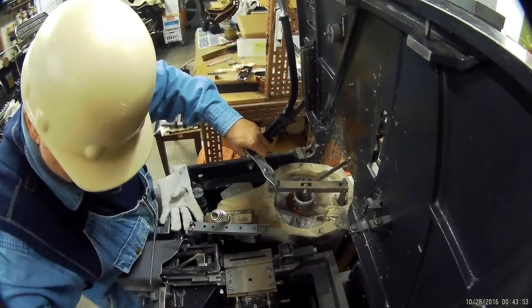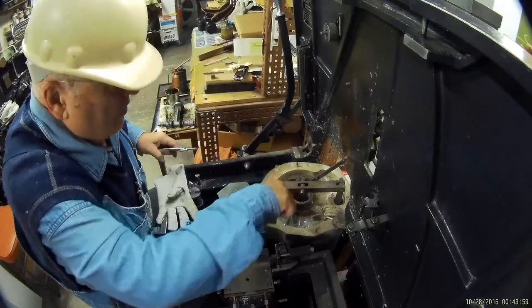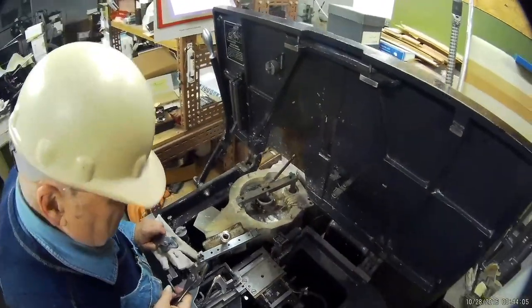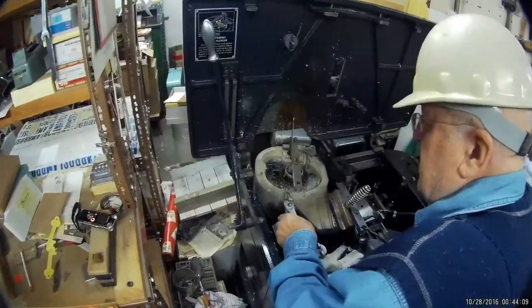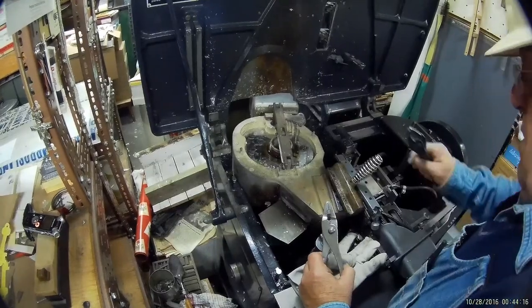Those pins go back. They're not locked at all then? Yes they are — I'll show you where. See that slot there, and that slot there? If you come around, you'll see a corresponding slot in the pot pin. See that dinky little slot there? This comes down — that engages that. It's locked now, it can't move.